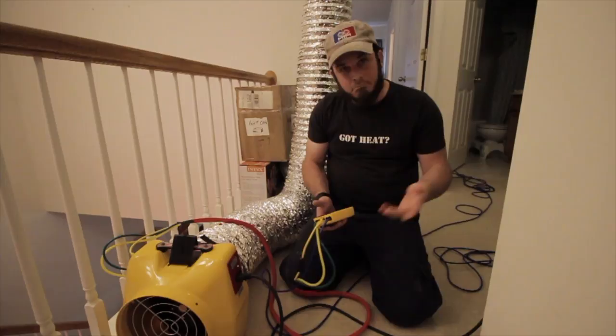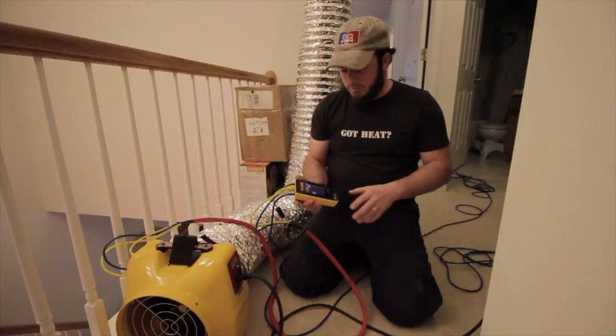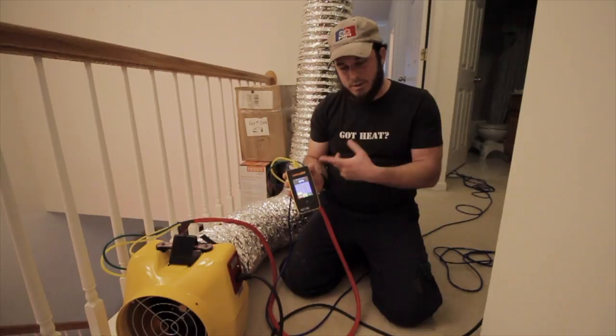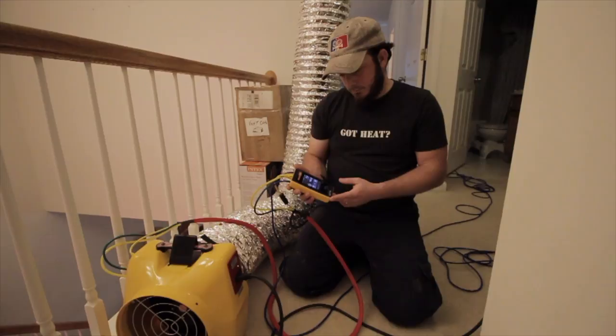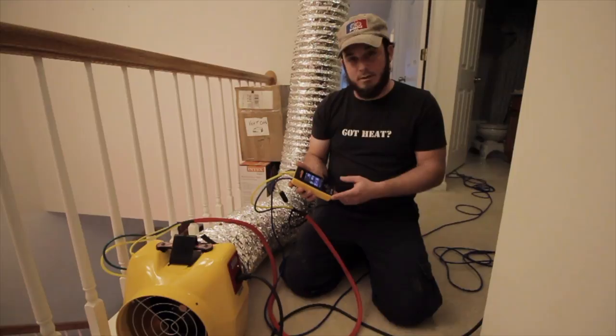So we had a little bit of a setup issue. I forgot to change the device for the control, so we were running the blower door, not the duct tester. Now I've got the device set to the proper device. We're on an open setting, and we'll see how that goes. Now, if you just hit set on 0.0, it doesn't do you any good. You have to put zero and press set, and then the system will operate as it should. I'll come in closer once it balances out. I may have to put a ring back in now that I'm on the right motor.